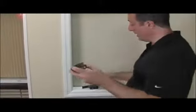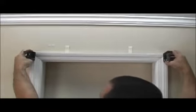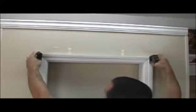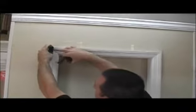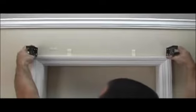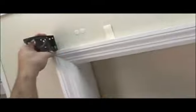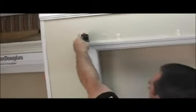There are a couple of different ways to mount these blinds. For an outside mount, if you prefer to mount your blinds to the outside of the window trim, just mount the brackets as shown. Pre-drill two holes — one on top and one on the bottom — before putting your screw in, so that you don't split and crack your window molding. If you chose to mount above the molding, place the bottom of the bracket on top of your molding, align the outside of the bracket with the outside of the trim, and order the optional spacer block that goes behind the bracket — there's no additional charge. That'll push the bracket far enough from the wall so it doesn't interfere with the window molding when operating your blinds.